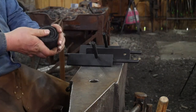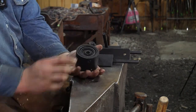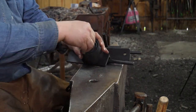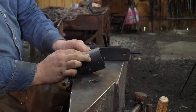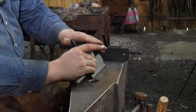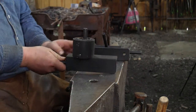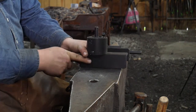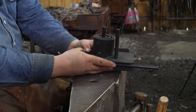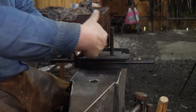All right, so now we have something very awesome from Robert Lawness, or Treadle Shed, as you know him here on the YouTubes and the interwebs. He has very graciously donated this hook bending jig. Jig, fixture, it's technically a jig. The way it works is you've got this Russian nesting dolls type of situation where you've got multiple sizes of pipe that all slip over this one shank, increasing in size by roughly an eighth inch of material at a time, so it gets about a quarter inch bigger in diameter as you go. These are meant to be locked in the vise. You lock them up, and you have one that holds all of your stack, and then you have your pivot pin that locks in the vise, and you slide this to find the right width of the material you're looking after. When it's all clamped up, now it's your hook bending jig.